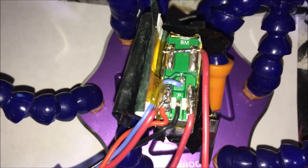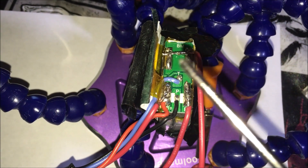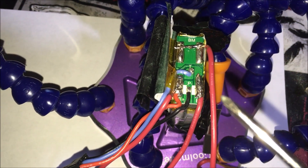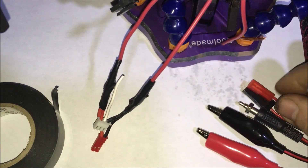That'll be the negative to the balance connector. We are almost done. To recap: we wired positive, we wired a negative, and that is a bridged area where if you measure positive to negative up there you'll get cell one, if you measure positive to negative down there you'll get cell two, and if you measure positive and negative that'll give you your total battery voltage. We ran the wires down and I have a JST connection here which is going to plug into a JST female connection right there into the B6.